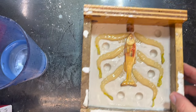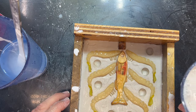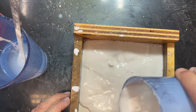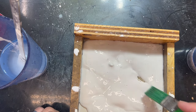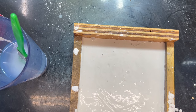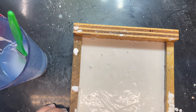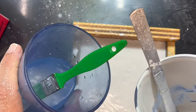Using a technique given to me by a regular viewer, I'm going to pour in just a little layer first, then take our plastering brush to brush out any bubbles. Just rock it back and forth a little bit to get the rest of these bubbles out. Always remember to reuse, reduce, recycle - wash out that brush before all that plaster hardens in there.